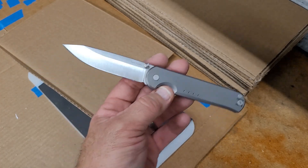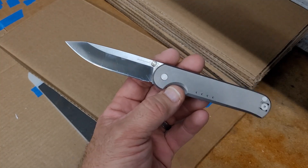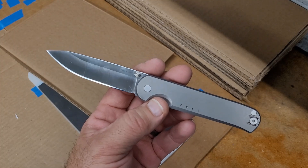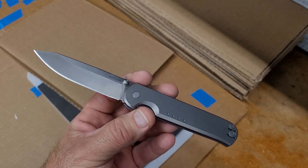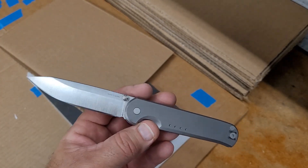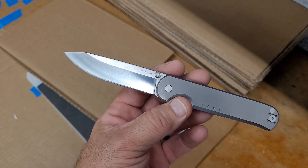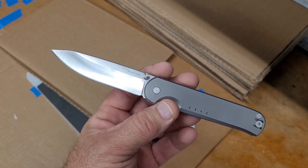Here's how it did. The first test was done on edge four, and I got 156 feet fine edge, 135 feet working edge, for a total of 291 feet cut in that one-inch section. I went ahead and sharpened it again the same way — 1500 grit, stropped the same way — and ran the verification test. On that test: 162 feet fine edge, 131 feet working edge, for a total of 293 feet.